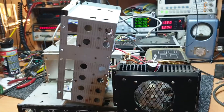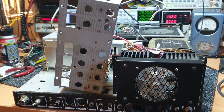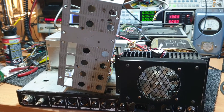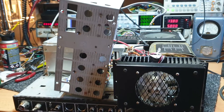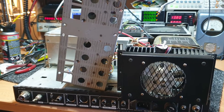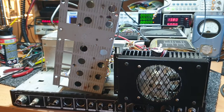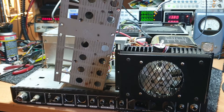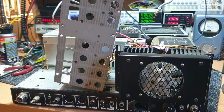I've actually been tracking down a PLL fault on this one. Initially I really thought we didn't have it — it looked like it might have been just not switching the right voltages. But after checking a million voltages, no — PLL is working fine. Unfortunately I would have preferred it be a PLL fault, because what I'm about to show you is just one of those painful painful faults, mainly because the parts are not available anymore in the right gain. Let me show you very quickly.